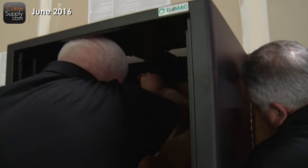When you're all done bringing in all your cable and everything looks nice and neat, and you're ready to start doing your punch down to your patch panel, ready to put in your routers, switches, and other equipment — maybe using this for video — you just close it and then you lock it. You can see the latch and how it locks. It's really strong. You hook up all your equipment, dress in all your cables, do all your punch down up here, and make sure these rails are adjusted to the size you want. It's nice and secure.